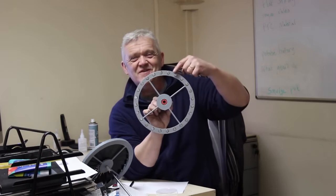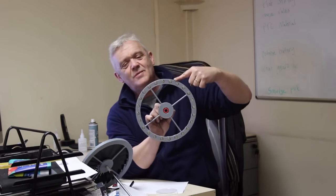There are always two ways of approaching generation. One is to put a motor on the end of the axle — for that we're going to need a fair bit of torque. The other way, which I absolutely love, is to stick the magnets on the rim. So I reprinted and redesigned it — this is the center wheel. You put the feathers in and we've got a load of magnets: one centimeter by two millimeter, going north-south-north-south at the end of the wheel. The bearings are actually in the hub, because with this arrangement it is its own generator all in one.